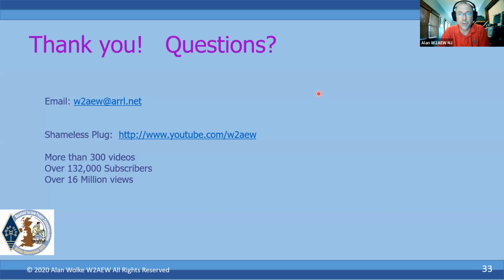Okay, does a calibrated spectrum analyzer with a tracking generator yield most of the desired results that you get with a VNA except for the easy phase angle measurement? This is from Mike, W2AEW. And the answer to that is yes. If you're only looking at magnitude results, and you don't really care about phase, a scalar network analyzer, which is effectively what a spectrum analyzer and a tracking generator is, will give you equivalent results. So certainly that's true.